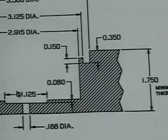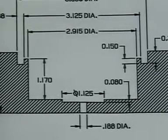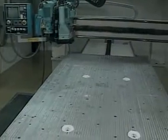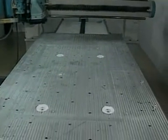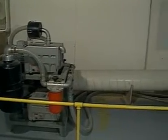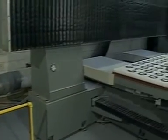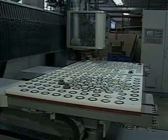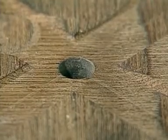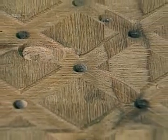The minimum workable panel thickness is one and three-quarter inches. Thinner panels will not provide the necessary space to mount the pods, while thicker panels will unnecessarily restrict the Z-axis clearance. The pod panel will be attached to a user-supplied router machine bed or table substrate and powered by a user-supplied vacuum pump. This substrate should be a flat plate of sufficient thickness with adequate underlying support to withstand the expected loads in service without flexing or movement. The top surface of the substrate must be of material that will not permit air to pass through it — that point is crucial to success.